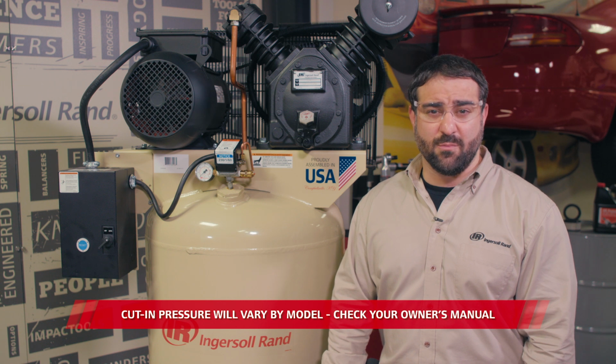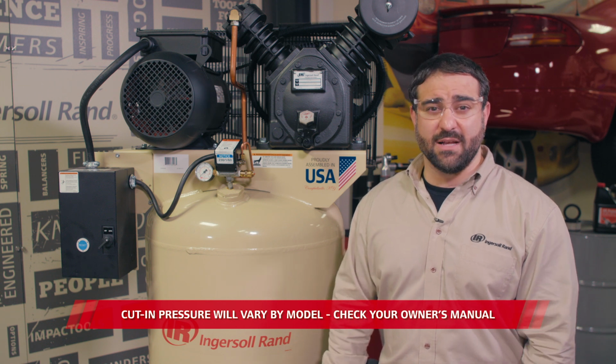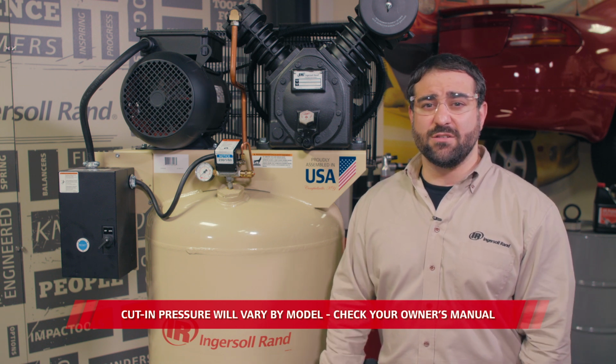The air leaking out is going to continue until the tank pressure reaches the cut-in point. That's 135 psi. At that point, the compressor turns on to refill the tank. This cycle continues over and over until the problem is corrected.